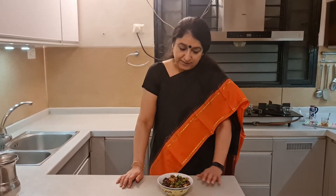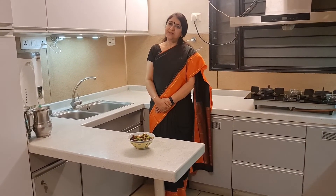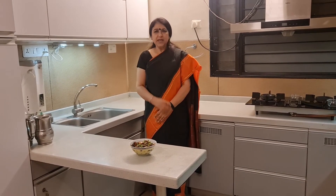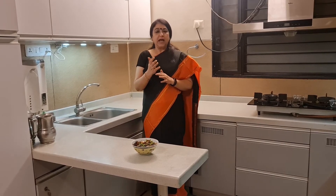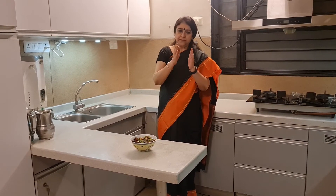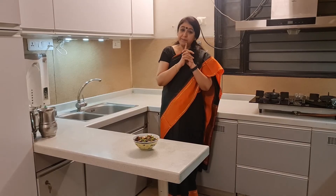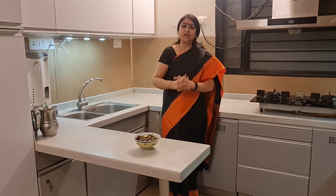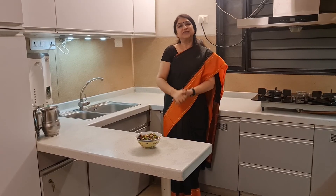So that was the recipe for the day, and with that we come to the end of today's recipe. But now it's time for the tip of the day. As you all know, I always give a new architecture or interior related tip. Today's tip is related to architecture during house construction. One mistake people often make is placing the flooring before the door chokhats (door frames). That should never be done, because the door chokhat is always embedded in the floor. So remember — once the floors are cast and brickwork begins, first place the door chokhats, then do the flooring after that, so the joint between the chokhat and the floor is sturdy with no gap.